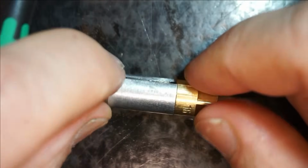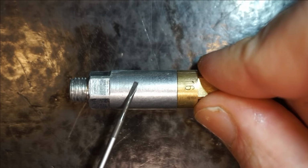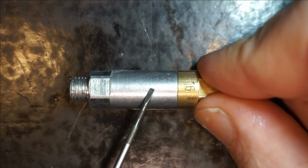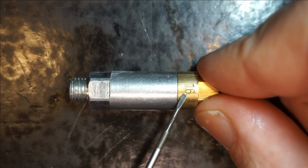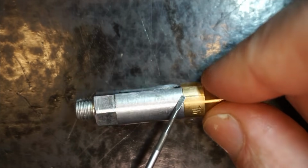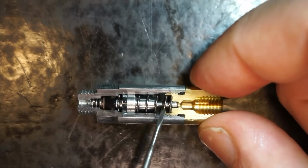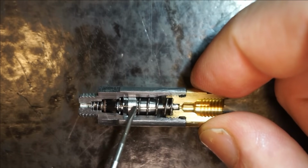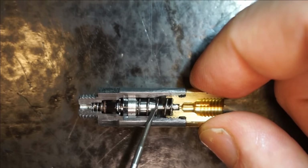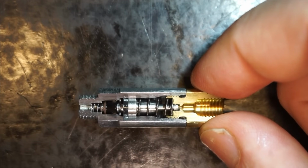And you may be a cheap guy like I am and source stuff like this from the used market. So you see, it is really no bummer if you can only source discharge volume types that do not fit your desire, because the only difference they have, if they have the same housing, is that the brass piece may have a protrusion on the inside that limits the piston travel.